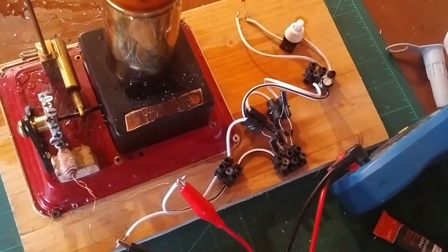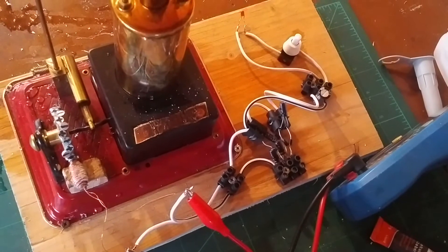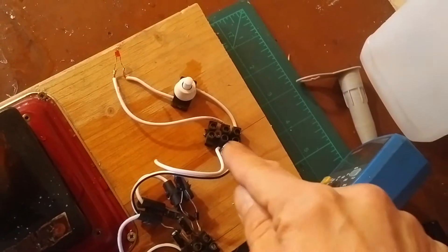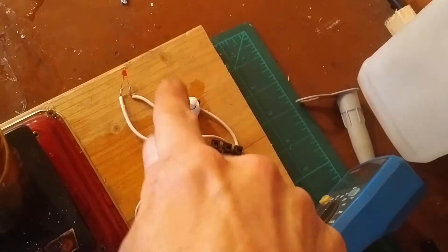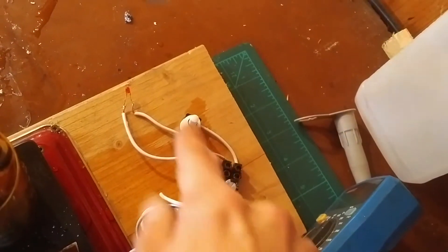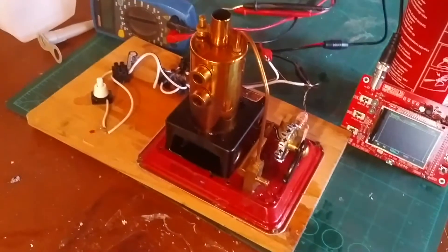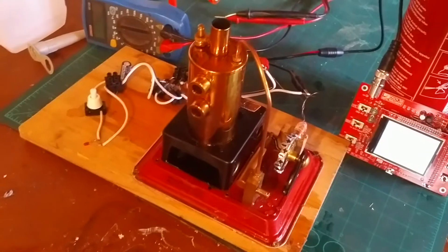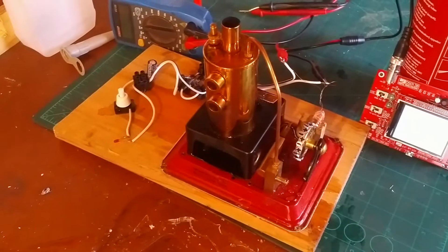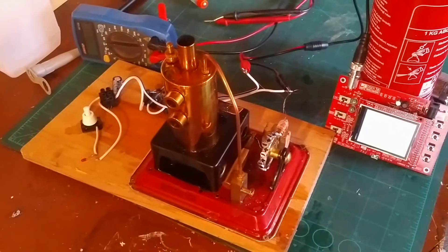Then I made a voltage multiplier circuit — it looks really messy, it is really messy, but I'm too lazy to draw a schematic. Just Google 'voltage multiplier,' look at the image search, and that's basically what this is. I also added a bigger capacitor which powers up as our energy tank, and with a switch here I can open it so the LED lights up for a quick moment. We have to wait three to five minutes to charge it. Also, the candle thing is a fire hazard — I found that pouring water into liquid wax makes quite big explosions — so I've positioned things carefully, but it's working.